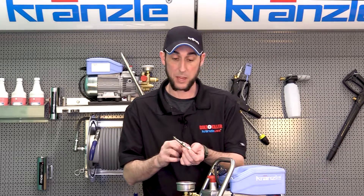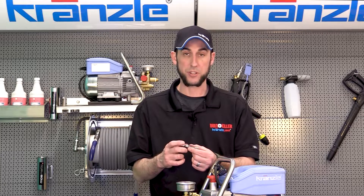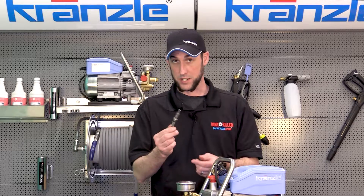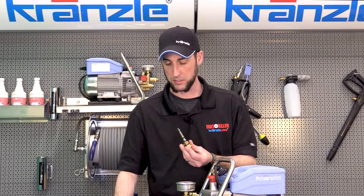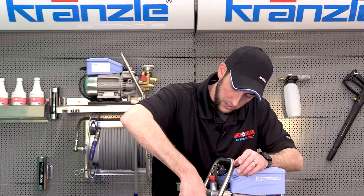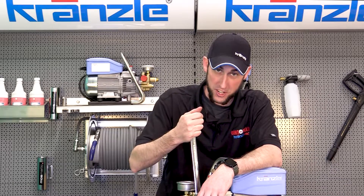Retest your machine and see if that makes the total stop function go back to normal. If there is something wrong with the piston, it's most likely going to be a broken spring — that can happen from freeze damage, but more often it's because of a leaking gun jet causing the system to short-cycle over and over again, so keep your accessories in good shape. Once the control piston is back together or you have a replacement, make sure you have all your parts, grease it with your preferred lubricant, reinstall, and hand-tighten until you reach the o-ring.